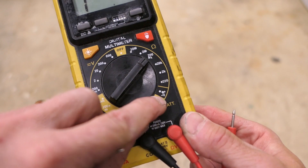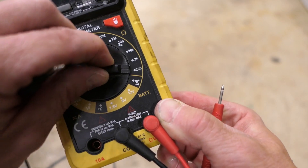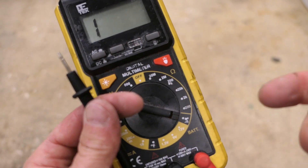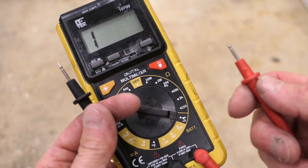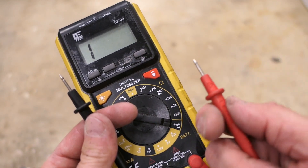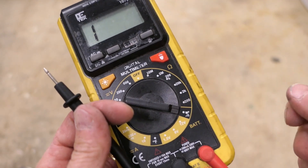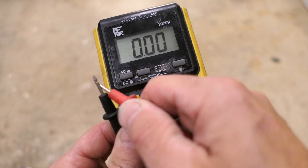There's another scale known as continuity. If I take it away from the ohm scale and put it on that, you see the one when leads are apart, and when I touch them together you see the zero - the same measurement. But there's a little beep from this meter. Sometimes you can't look at the meter because you're busy doing something else. If you're just trying to measure continuity, you can use this scale instead of the ohm scale and it will beep at you if there is continuity. If your meter doesn't have that, just put it on the ohm scale.